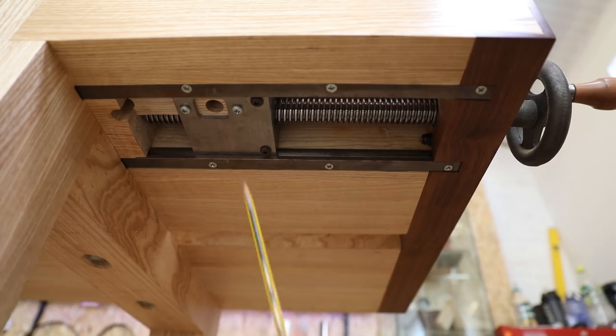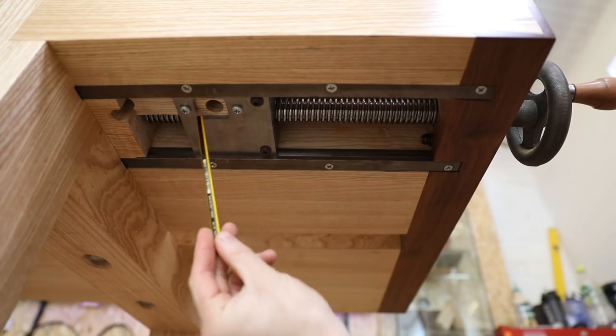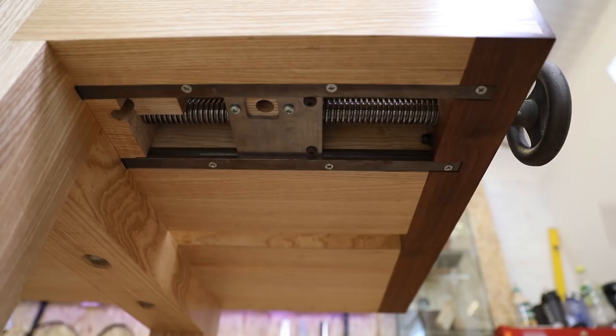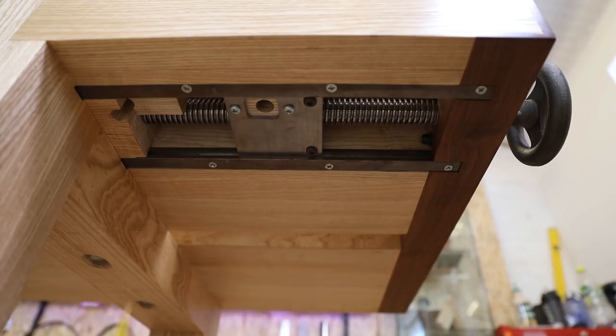Lessons learned. Once you've got that whole mechanism fitted, the only thing you've got to do is screw the dog block in place — two screws attached straight into that bit of wood that moves with the wagon underneath. You obviously need to align the dog block with the cut-out, and it's machined square in case you want to use square dogs as opposed to round dogs like I've done here.